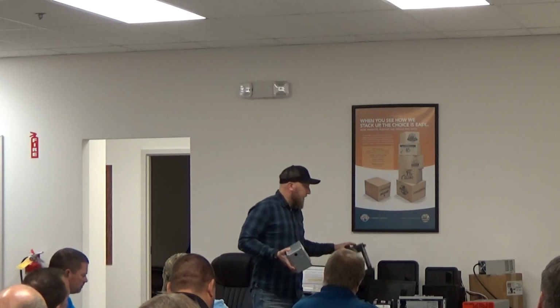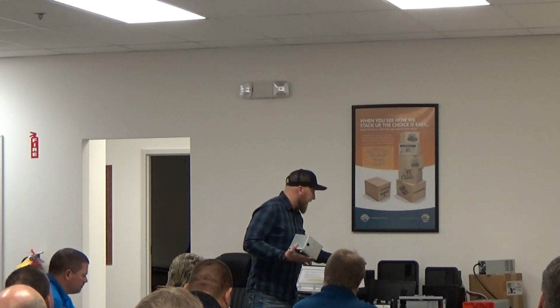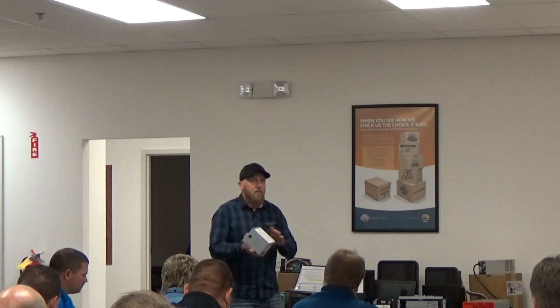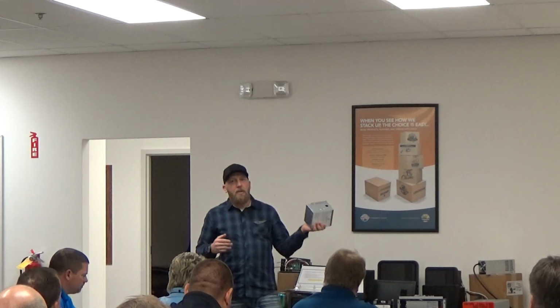Like I said, these are the same thing, one's for 30 amp service, one's for 50 amp service, so there's not really any difference other than the wiring coming in. So 30 amp service, you got one leg of 120, 50 amp, you got two legs. That's the only difference, they do the same thing.